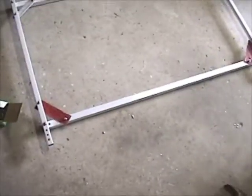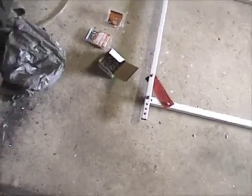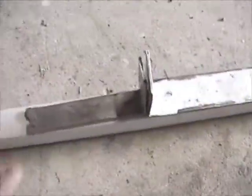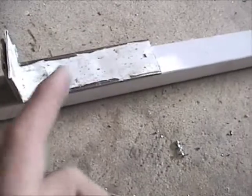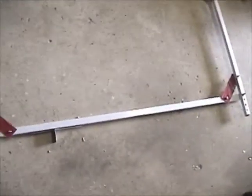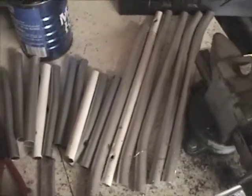I figured out how I'm going to attach the rigid parts of the legs - the parts that just stay still and aren't rotating around. I wanted to get some kind of L bracket, so I've been taking little pieces of tube that I have left, flattening them out. What I'm going to do is put two pieces together, more similar in size, bolt here and here. Then there will be a bolt hole here and this is where the piece will attach, so it sticks up from the chassis - actually it'll probably be sticking out on the sides. I'm going to flatten out all these pieces I've cut to make these brackets with, some L's and some U's.